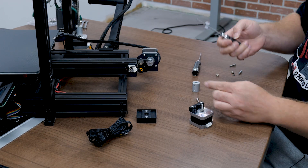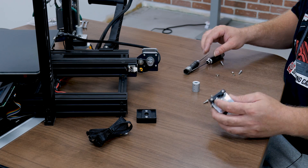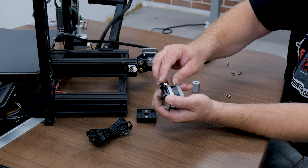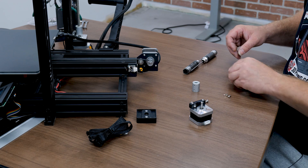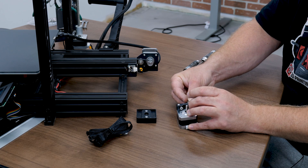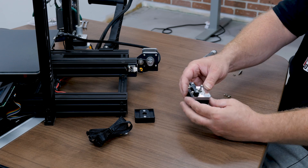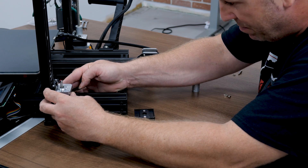Our 2.5 wrench. What I like to do is get the T-nuts on there ahead of time. With T-nuts, you only want to thread them on a little bit so they'll spin inside and catch. We'll install the next one — just a couple of threads on there. Now I can go ahead and take that motor, give it a little wiggle, and it'll slide in place.